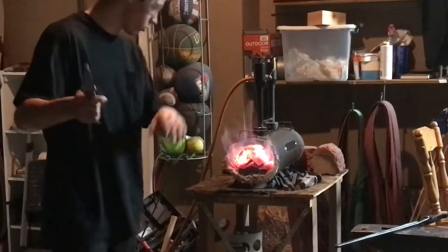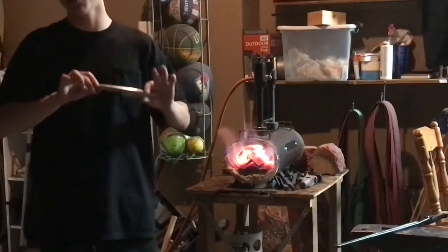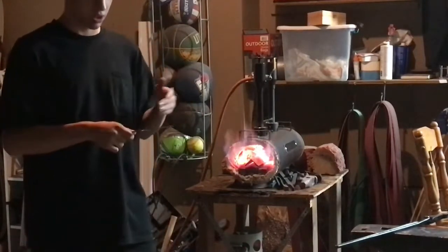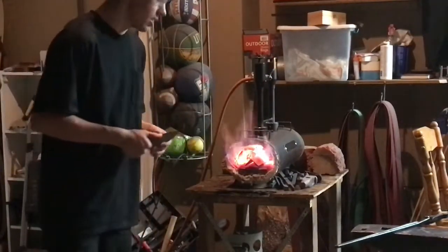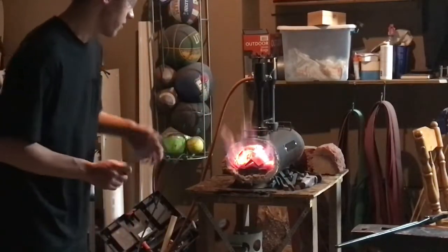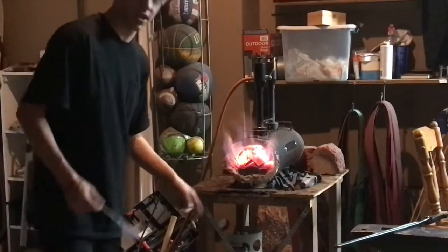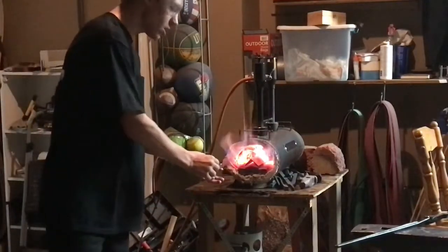Let me just go over my steps real quick. First, obviously clean your blade. Make sure there's no scale left over, no extremely deep scratches from 36 grit or anything like that — nothing that could cause it to crack or be more or less hard on the surface. Going in, I'll let my forge heat up fairly evenly, move the blade around, up and down, make sure it's all in the heat, and then we'll go past the critical.